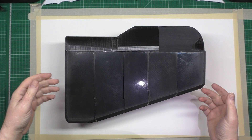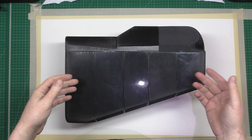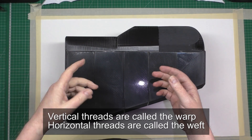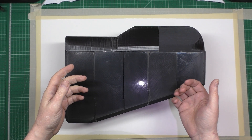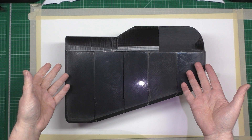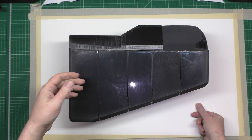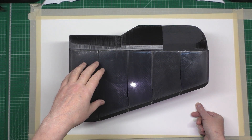I'm going to skin it with carbon fiber - 3k carbon fiber. The k rating on carbon fiber is how many strands there are to a strand on the weave. 3,000 strands. I've got some 12k carbon fiber but I'm not using it because it costs too much and I've never done this before. The more strands you've got, the stronger it's going to be.